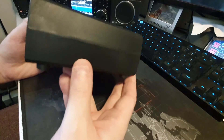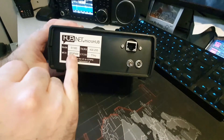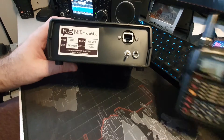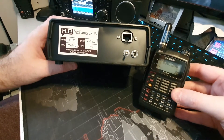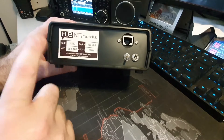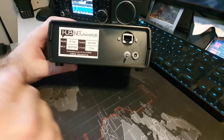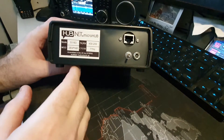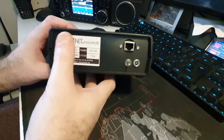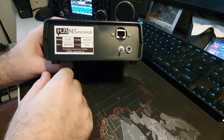Just a plastic project box. On the back it has a nice label with a CTCSS tone, your call sign, your node number, and the frequency. So all you have to do when you get one of these boxes is program the frequency in, put the CTCSS tone on it. When you boot this up, it'll give you its IP address on your network — like 192.168.0.whatever. Then you basically go on the computer, put that number in your browser, and it'll take you to the dashboard where you've got loads of options. I asked them to put an Ethernet port on there — it's just the Raspberry Pi inside with a pigtail to an Ethernet port. This will run on Wi-Fi, but I do like to hardwire everything in if possible.